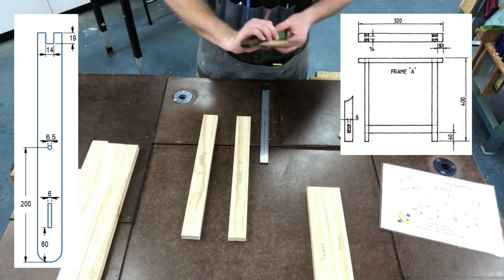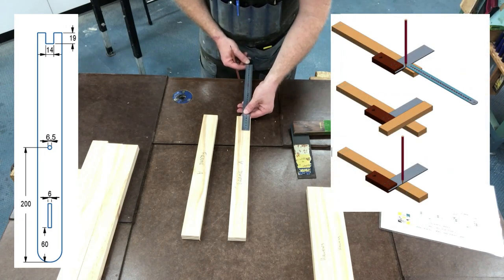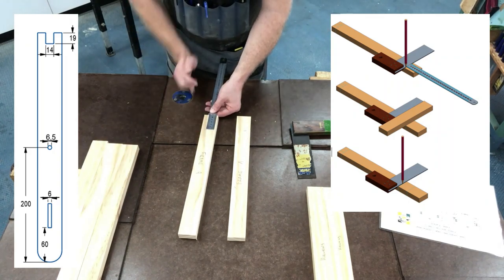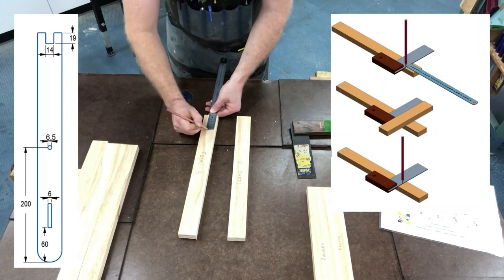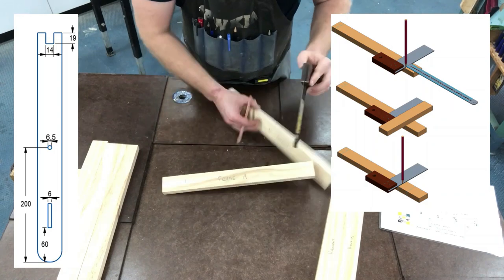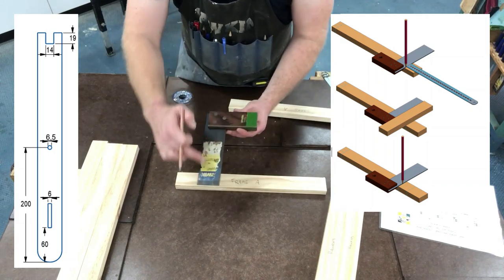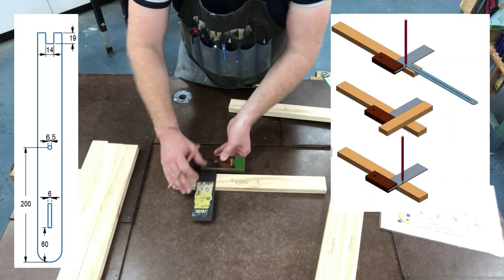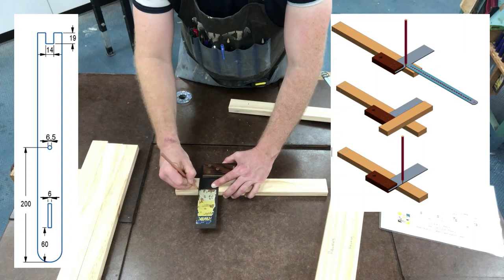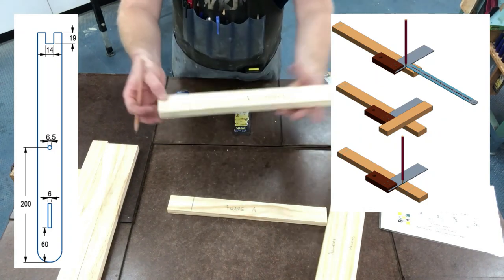Also have your trisquare here. We're going to measure 60mm from the bottom — sit your steel rule like so and mark 60mm. Do the exact same on this side. So that's 60mm from the end. Grab your trisquare — make sure you use it correctly. You have the blade and the stock; the edge of your material must be running up alongside the stock. Line that up and pencil in that 60mm mark.